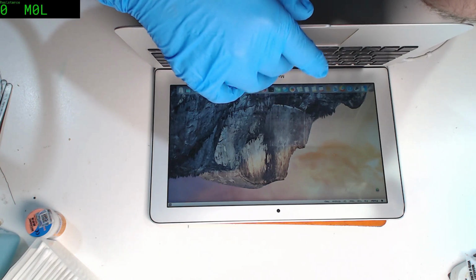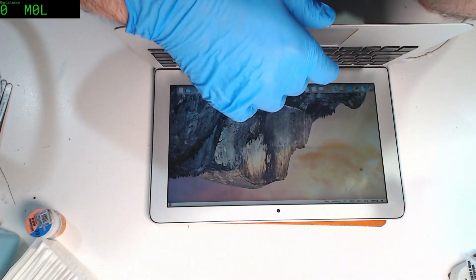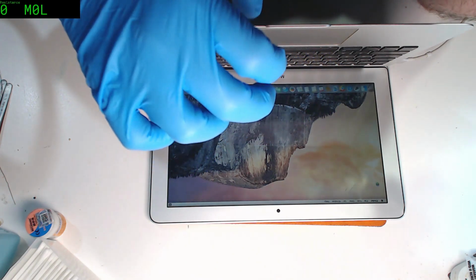And, right, we've got Yosemite here. That's good. Mouse works. Alright, we're going to close this down. I just realized this is actually my build system for Flex Boardview for the Yosemite. So best I don't mess this one up. There we go, another fix, except this time is a 1465 instead of a 1466. Cute little machines, can be very useful if you've got a limited amount of space, but it was nice to see that this one was simply the input impedance resistor there for the detection of the MagSafe, and the SSD just looks like something happened to the data on there, got converted over to NTFS for whatever reason. But other than that, the machine seems to be going good.